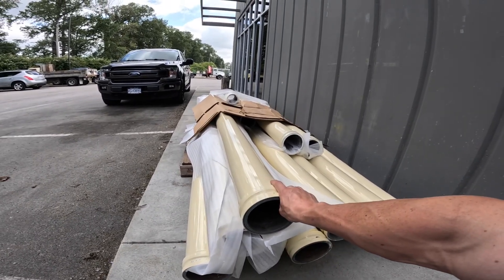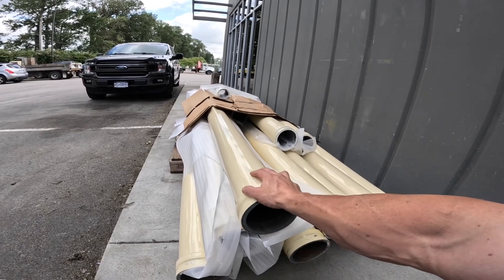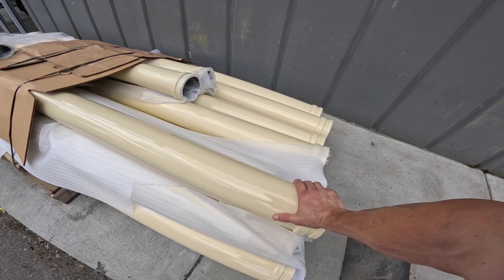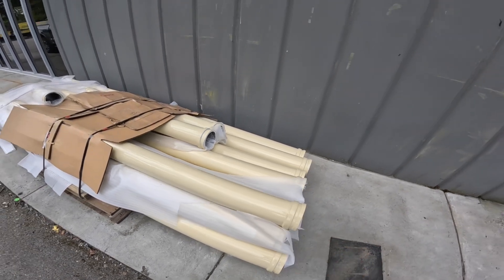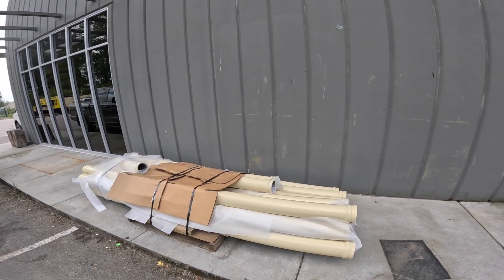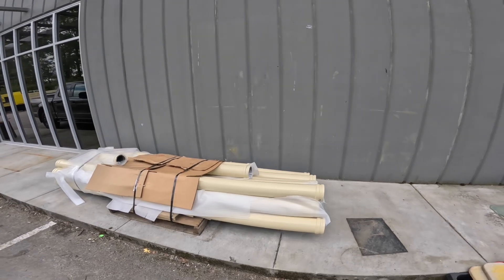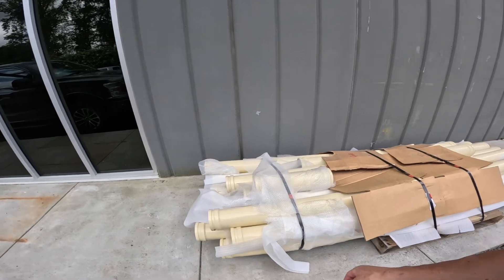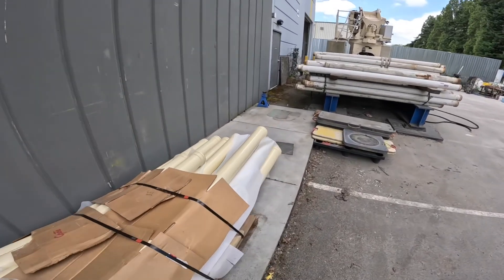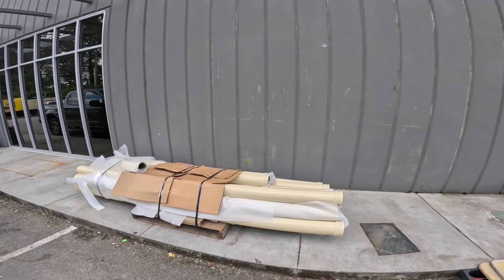So we're replacing those with Conforms Ultra 3 single wall heat treated pipe. The reason is the elbows that are on it are only about 70%, so there'd be no point matching up with brand new twin wall pipe. Also, this is the boom that often comes off the pump and goes up on the high rise — it's nicer having single wall in a high-rise application because you can use ultrasonic pipe testing on site. With twin wall, you can't use an ultrasonic; you have to use a caliper and take things apart. Also, single wall is more resilient if laborers end up tapping pipes with a hammer. We see about 40,000 meters through a set of this stuff.